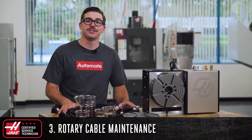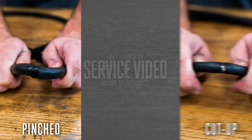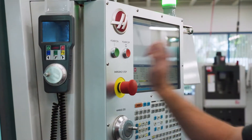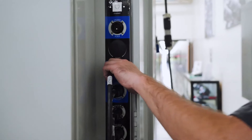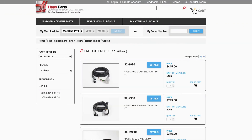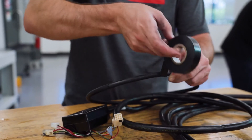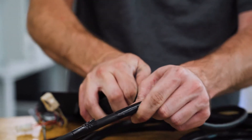Even though the cables on your rotary are designed to live a long life inside your milling machine, there are times during normal operation where the cables can get pinched, cut up, or frayed. It is good practice to routinely check for damage to the outer casing and for exposed wires. If your rotary cable is damaged and has exposed wiring, stop operation and unplug the unit, as the exposed wires can ground themselves to the machine and potentially harm the operator and the rotary unit. Contact your local HFO or go online to HaasParts.com to get a replacement cable, which will ship the next day. In the meantime, if the cable damage is not severe, you can wrap the exposed wires with electrical tape, which will allow you to safely operate your rotary until the replacement cable arrives.